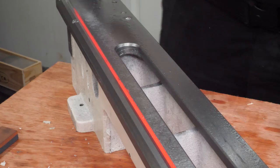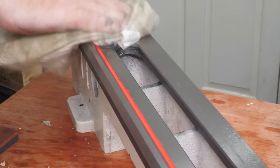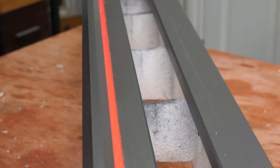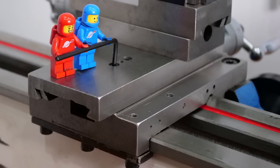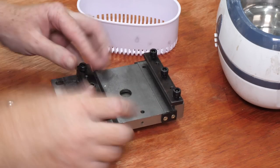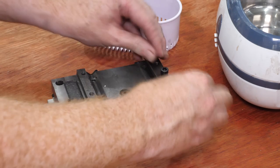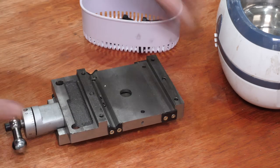After all the deburring, the bed needs a wipe down with WD-40 to remove the chips and any loose abrasive from the stones. The bed is now done, but there is still a big pile of other components to clean. The first parts to remove are the hold down plates from the saddle, which are attached by three screws. Most of the carriage parts are small enough to go into the ultrasonic cleaner, which can thoroughly clean, degrease, and remove any grit and abrasive from the parts at the same time.